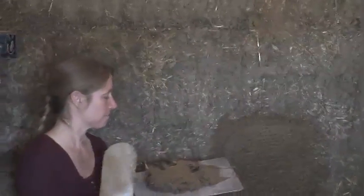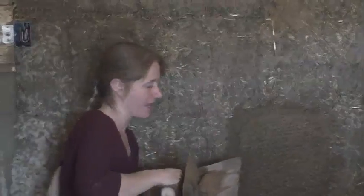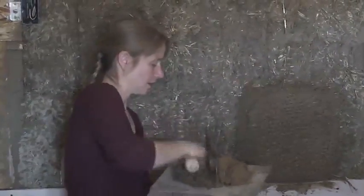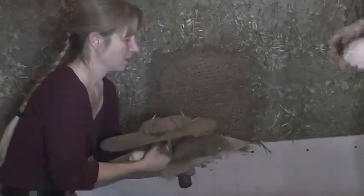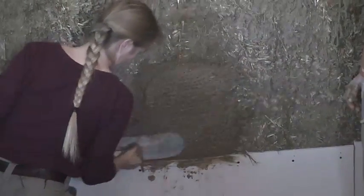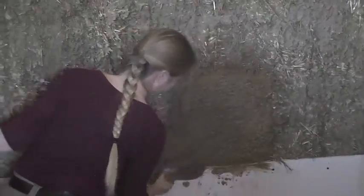A quick lesson with a hawk and trowel — this is pretty heavy stuff to be using. It's nice to put it on my hand, but if you put some on a hawk and trowel, I usually sort of cut it up and then pick it up this way. I'm tilting my hawk almost sideways, planting that bottom edge, and then working it up and in.